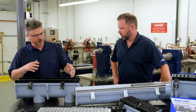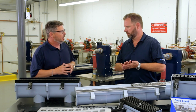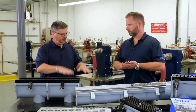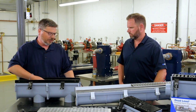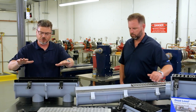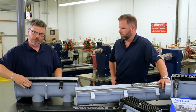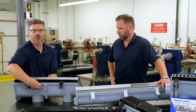A lot of times you'll have different class ratings of your trench drain grates — different load classes, different weights. You'll have airports, gas stations, and so forth — a lot of heavy machinery. So weight distribution becomes very integral to our trench drain. You've got forklifts going over this with thousands of pounds of material on the front of that forklift. You have flex and things that can happen — cracking of concrete. By interlocking our frame to our polypropylene trench, that also allows the weight distribution as something goes over this frame. The weight distribution is put into the surrounding concrete around it; it is not supported on the plastic trench itself.